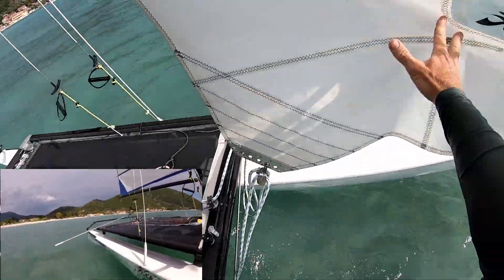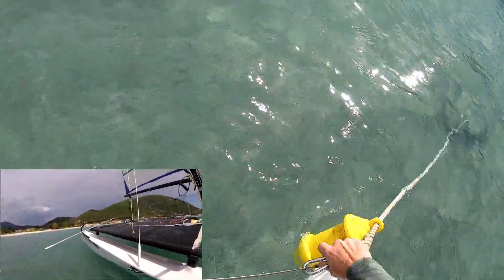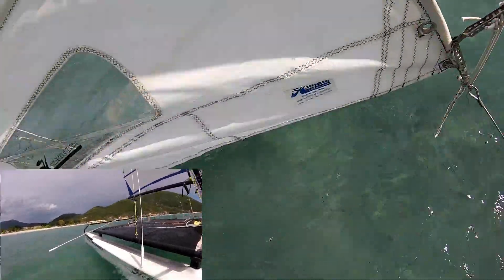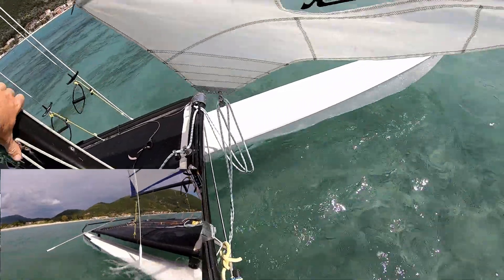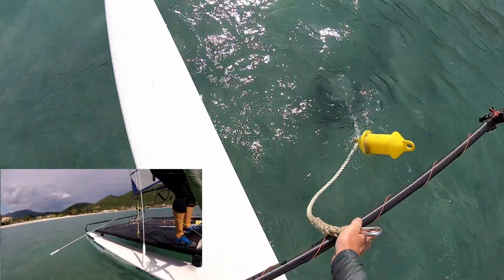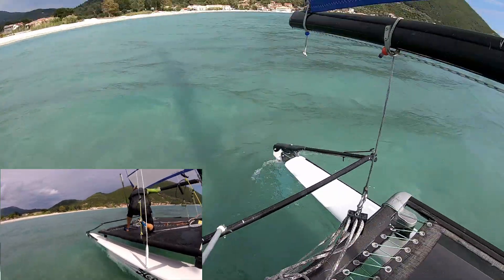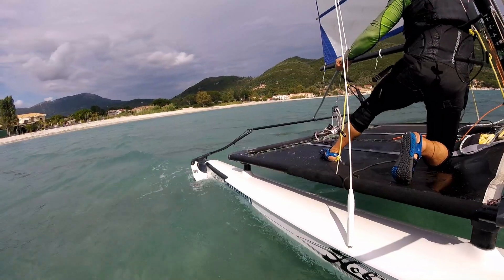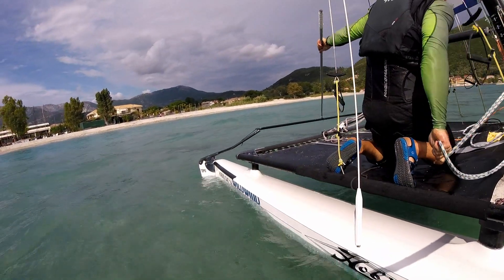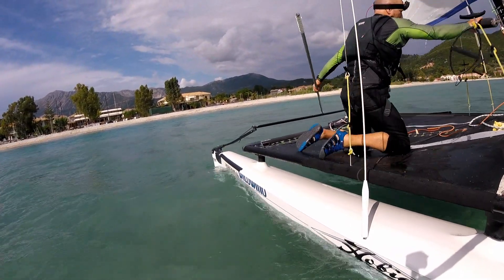Jib travelers are good. Standard departure — going to the bow, grabbing the mooring line, now walking back to help bear us away. We've lost the mooring line, not to worry. We'll just reverse the rudders and get forwards a bit. The worst thing you could do for your rudders is touch the bottom going backwards, because that will just snap your rudder pins.